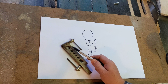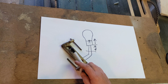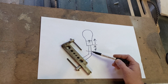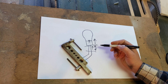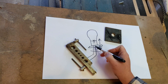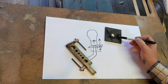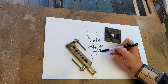What we already have is from a flaring tool — a regular plumbing flaring tool. This is a five-eighths collar right here, and the shaft is just a smidgen under five-eighths, so I'll wrap this with a little bit of burlap or duct tape — some kind of heavy cloth that will compress inward but leave the shaft itself unscarred. Then we need a steel plate that can sit right here and go around this shaft opening. We can simply saw-cut it right there so it can slide around the shaft, and this part can push upward against the knob.